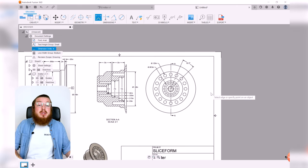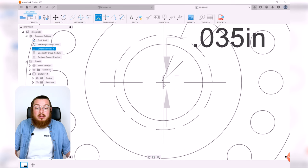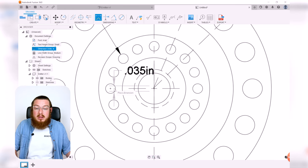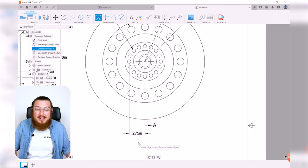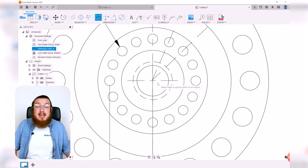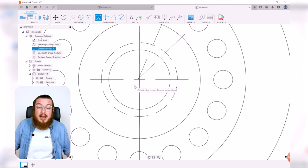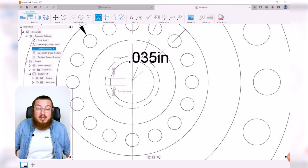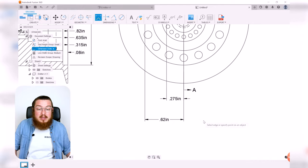And this will also give us a really neat point to actually click to. So you can go ahead and try and get, yep, right there to the very middle, and then click the inner circle ring. Pull that down. Again, that should be a nice neat number. If you're getting a value something like 0.5, 0.6, or something that isn't that, it's very easy to accidentally click the center of those two lines that we made in the sketch. So then again, we can click that center mark, click the outer one, and again, this is also a nice neat number.